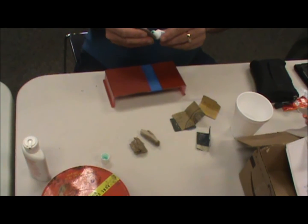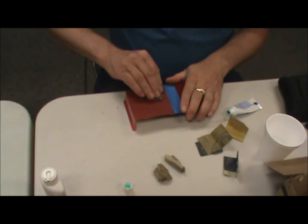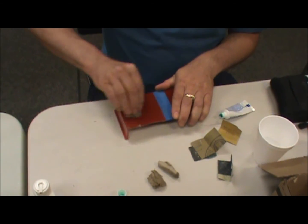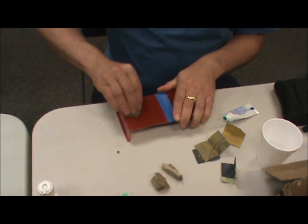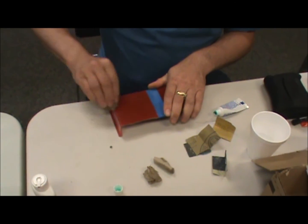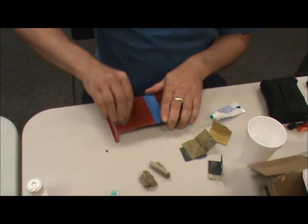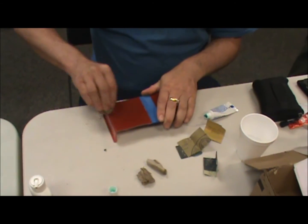The next step, once you've got the finish sanded smooth, is to take out your toothpaste and just start polishing. You should polish with a damp cloth. About a minute or two with the toothpaste will get you what looks like a really, really nice glass-smooth shiny finish.